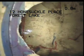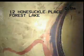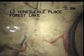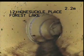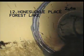Now where are we? 0.8. I don't see any glue coming down. I think this is an inspection pipe, as far as I can tell. Hang on. Okay, so we've got an inspection junction, right? Okay, so we'll head around to the right. Okay, so we're at 2.5 metres. This junction appears all okay.